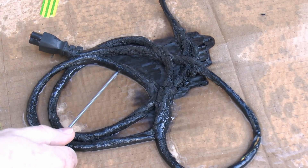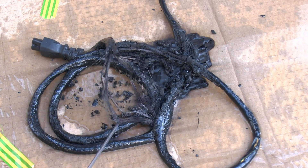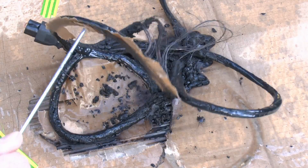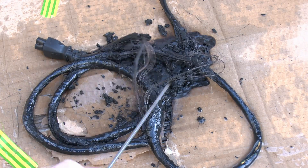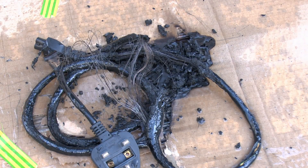Here are the charred remains. The plug on the end is fairly intact, but the cable is totally stuck together and stuck to the cardboard surface it was resting on — completely charred and burnt away. You can see the wires have actually got a silvery colour to them, which shows they're not solid copper, as copper is not silvery coloured. So they're probably copper clad aluminium, as they weren't actually attracted to a magnet when we tested them before. That accounts for the excessively high resistance even if they were the right size — which size-wise they were probably in the right area. Clearly though aluminium is not a substitute for copper at the same size. The cable just ripped off the plug — totally wrecked. The two end parts were actually fine in terms of current carrying capacity, but the flex in the middle is what ultimately failed and melted into a pile of charred wreckage. Thanks for watching.